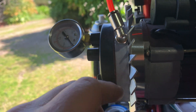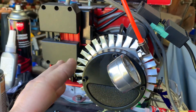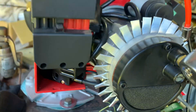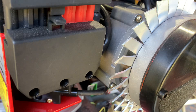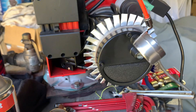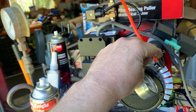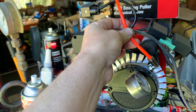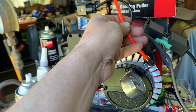A large diameter hose clamp. These little fins take a fair bit of the heat and dissipate it off. They've got a twist on them — the twist helps with natural convection and allows the heat to move off of each fin without heating up the following one. As a result this pump runs a heck of a lot cooler. The temperature of the air coming out of the line here is a lot cooler; I've actually had a couple of these lines get so hot you can't hold them.